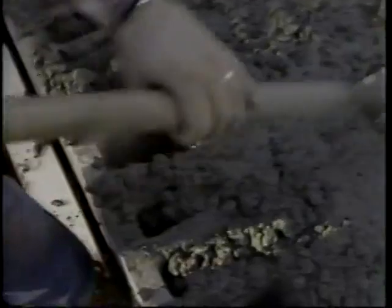Norm, how come it's so important to get all this concrete in the hollows of the block? Well, it's really not that critical except for where the anchor bolts are going to go. But while you've got the concrete, you might as well. You end up with almost just like having a poured foundation. It becomes one solid concrete wall. And they're not that bad to fill.